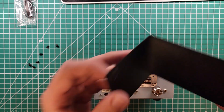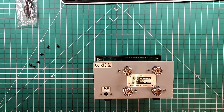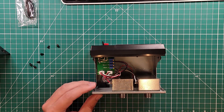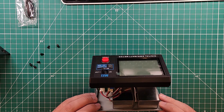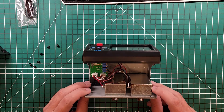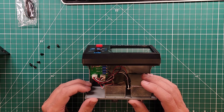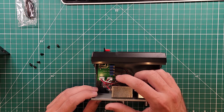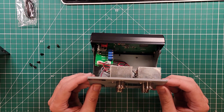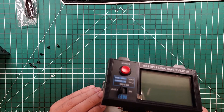Alright, those are recessed so you gotta spread it out a little bit to slide it up. No problem there. And not a whole lot going on inside, which is what I kind of expected. We have RF shielded inputs and outputs, HF and UHF/VHF inputs, and a couple of trimmers to get this thing tuned even more if you had a reference standard - so that's pretty nice.